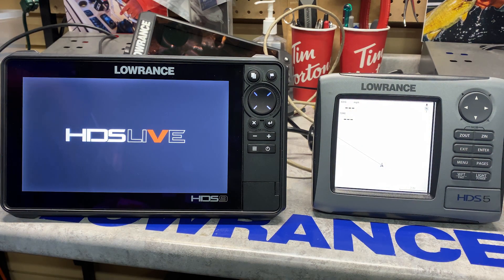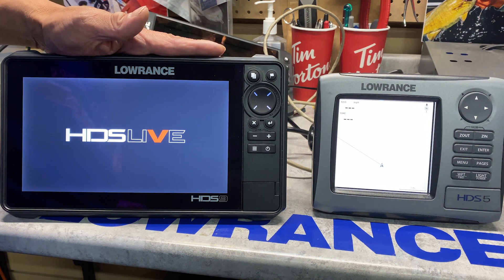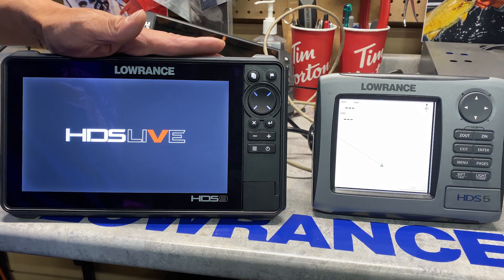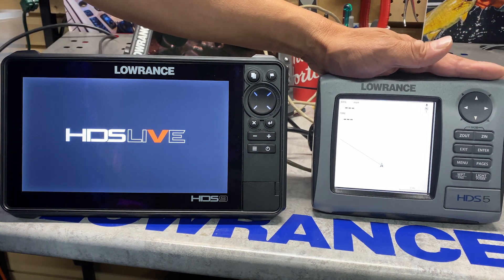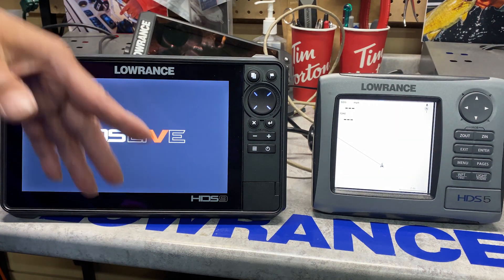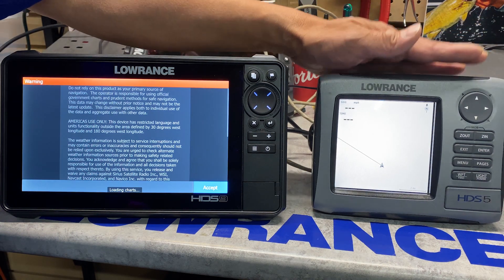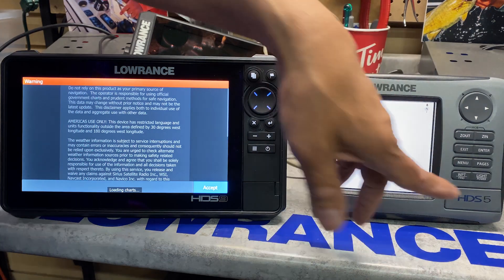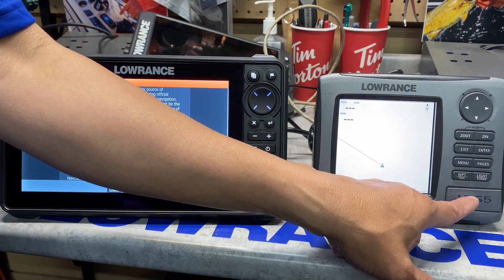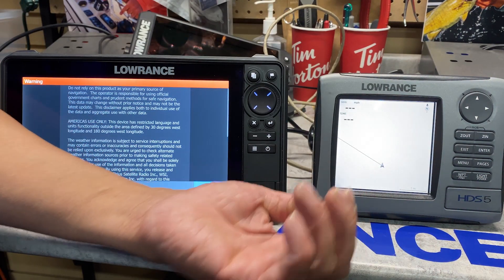Right now we're turning the fancy new unit to slow mode — or dummy mode as we call it. It's fine because a lot of our consumers don't have the budget for two newer, fancier units and they have lots of older, good Lowrance units. They're going to still network, and the fancy unit will still have its good side scan, but the other unit will not recognize anything except the standard transducer. A Generation 1 will not Navionics share, but a Generation 2 and a Generation 2 Touch will still Navionics share — that's a nice feature even on legacy mode.